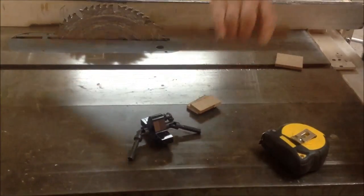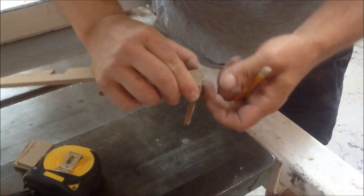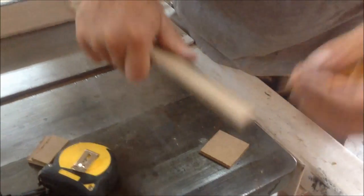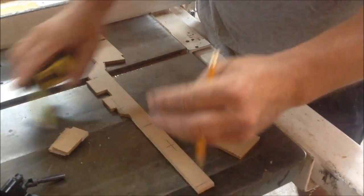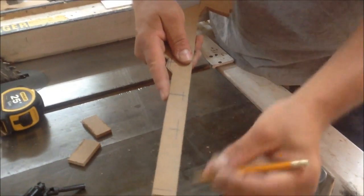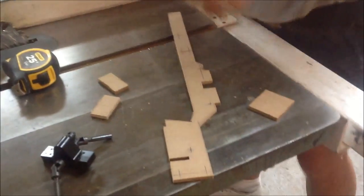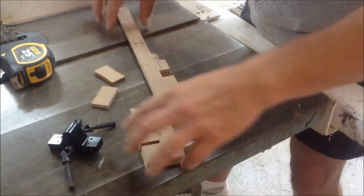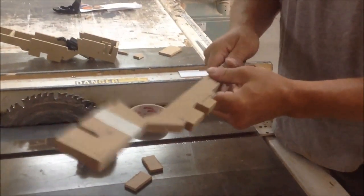Keep these pieces and roll the others out. For your holes, take your finger gauge. I'm going to leave about a quarter of an inch — maybe an eighth of an inch of room. I'll just transfer a line over, and the same thing with the back — transfer a line over. My battery is five and a half inches, so I'll just go five and a half inches and draw another line down here so my battery fits in between. Then draw your cross marks for where you're going to drill. So those are all the holes that you need. Then you double this up, take some tape, and tape it together. So now we're going to go to the drill press and drill out our holes.